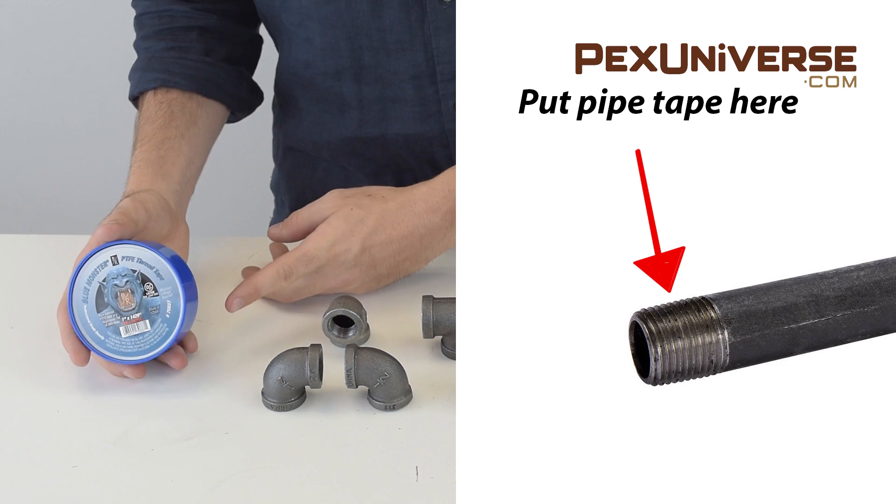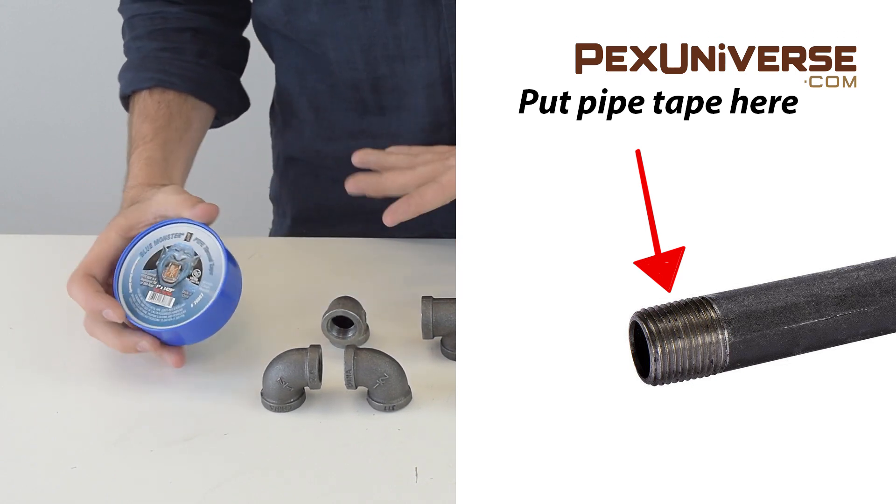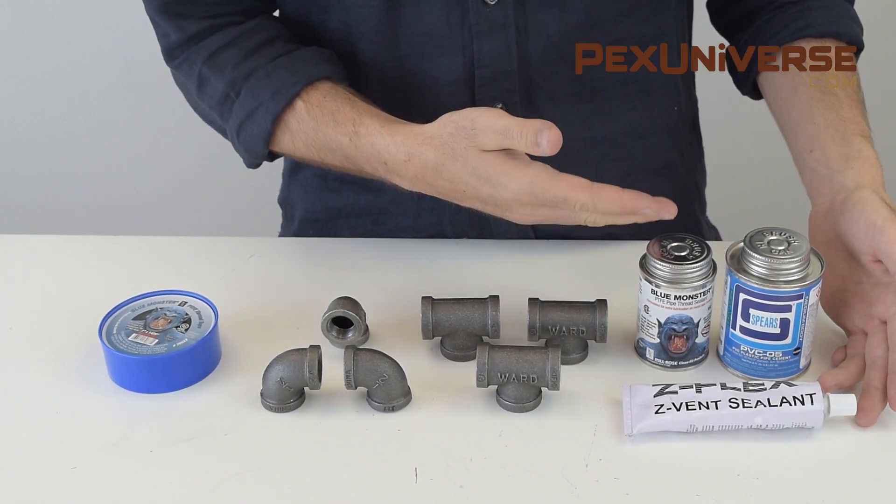So here are a few suggestions on how to do that. You want to apply the pipe tape to your pipe thread first — it'll create a thin film which seals the threads — and then thread sealant will provide the lubricant needed to screw these fittings in.